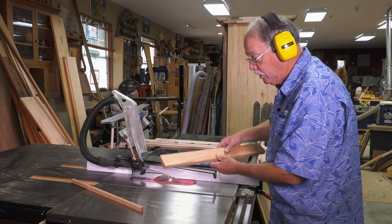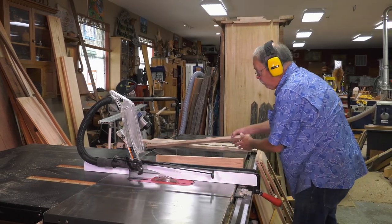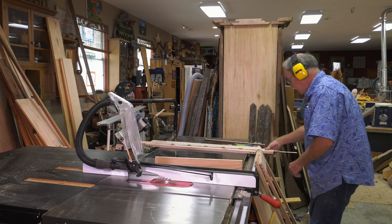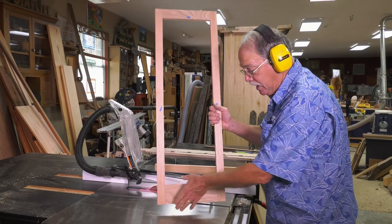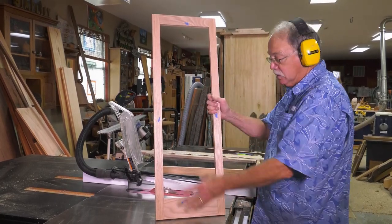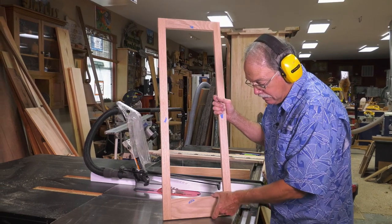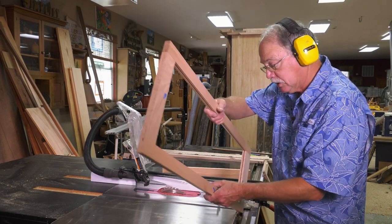And this is 2.5 inches thick, like that. And then I've ripped down red oak to 1.5 inch thickness. That's 38 inches long there. And for the door frame bottom and the front of the case, which is identical in looks and dimension to this, except it's 1/8 inch wider, meaning that's 1/8 inch longer down here, that piece is 3.5 inches in width, all 3/4 inch thick stock.